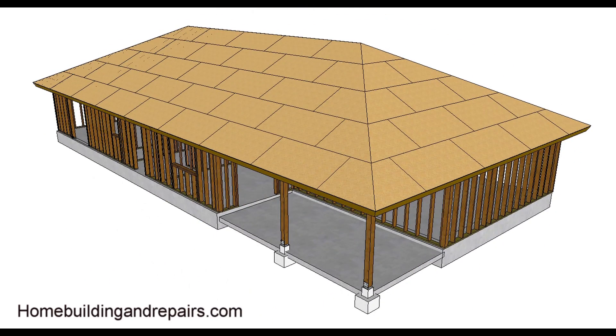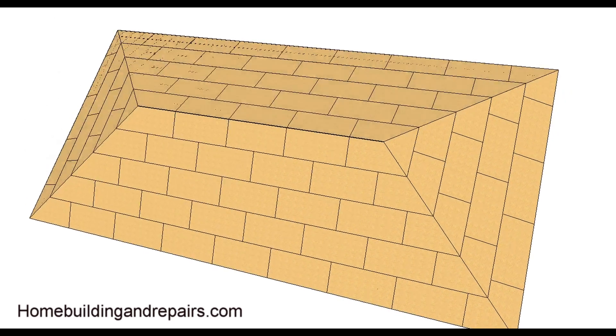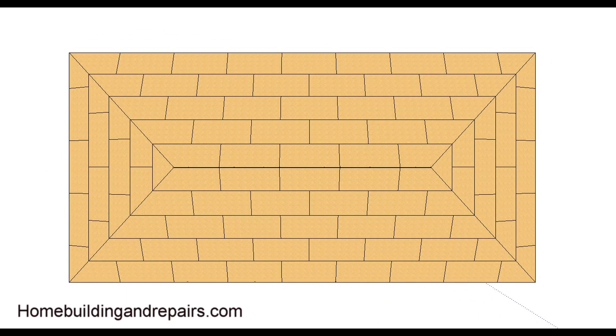You can see the roof sheathing here — these four-by-eight sheets — and the corners will need to be mitered. In some cases you won't be able to cut them flat. The steeper the pitch, you might actually need to cut some type of an angle on the plywood. For example, you have a square cut on this side, square cut on this side, and on this side, but this one might actually need to be angled a few degrees to make it work. I noticed that with the steeper pitches for sure.